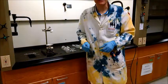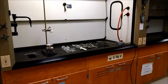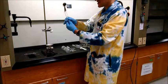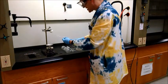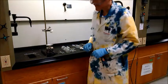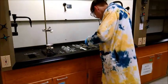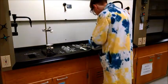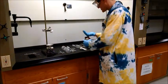The Cottrell pump is very fragile — it's thin glass tubing in the shape of a little triangle. These are tubes, so vapor can go through. You'll want to gently place that into the distiller. But first, we'll add a few boiling chips so that we get even, smooth boiling.